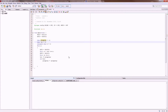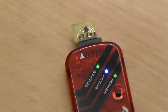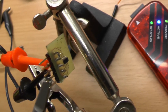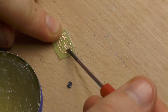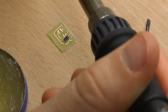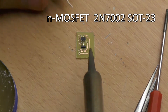This is a soft PWM — I didn't have time to go into details of the microcontrollers yet, it's ramping up and down. I had to solder the microcontroller on a small programming board first. It worked like a treat. I desoldered it and put it on the actual Rudolph board. The single MOSFET is actually the same package size.